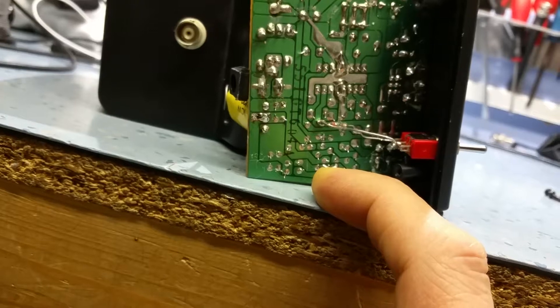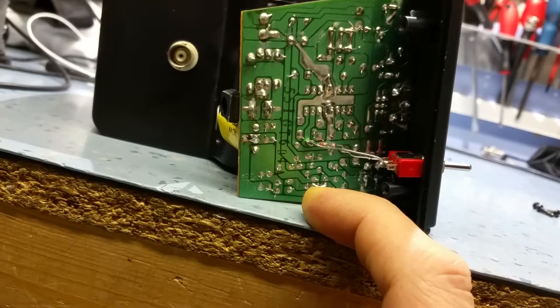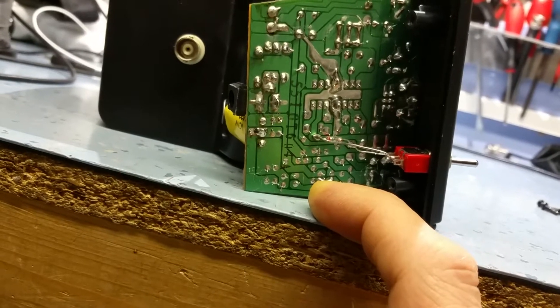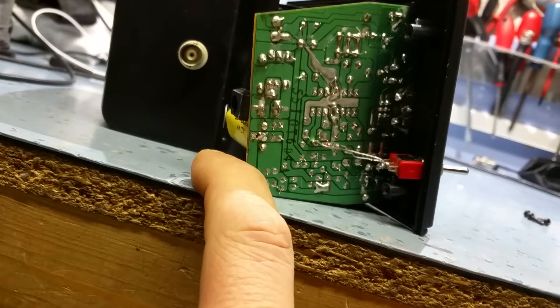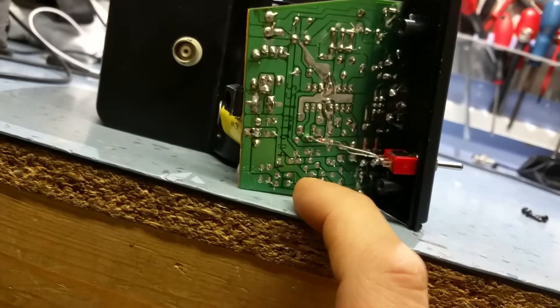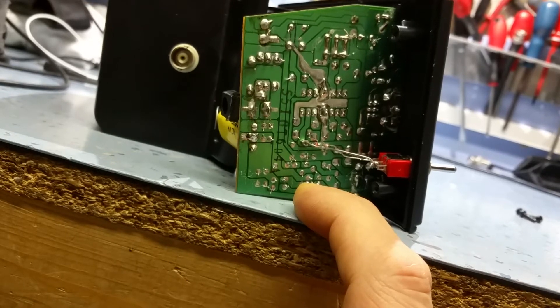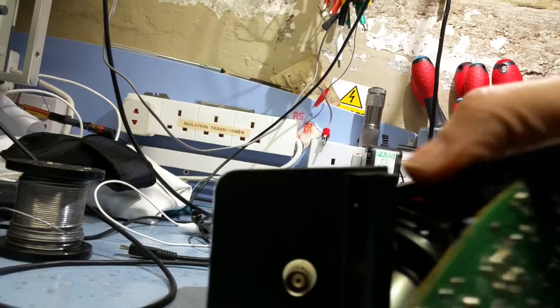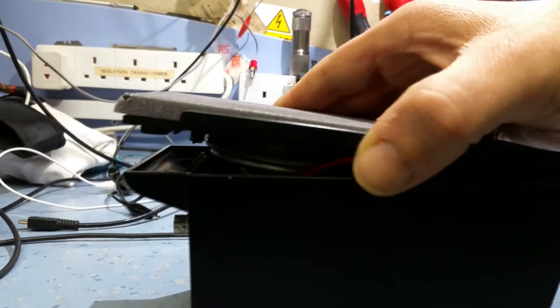The idea is that I should be able to trace an audio component in an RF stage. If you're tracing through an RF section you should be able to detect audio coming through. Hopefully working on a high voltage — a couple of hundred volts — with that decoupling capacitor in the front end to stop any DC getting through. We'll have to try it at high voltage to see what it's like. I'm working a bit blind here; I haven't actually downloaded the circuit — I just thought I'd give it a go.